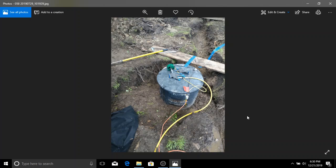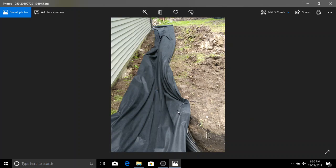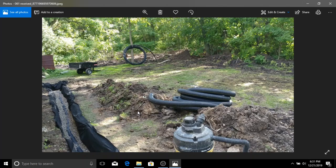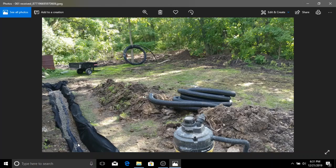Got it empty and then started filling back in — now I'm starting to put stuff back together. Laying out the fabric around the garage. I got fabric going in the front, the slotted pipe, and then the solid pipe — that's the solid pipe for the downspouts on the west side of the garage. The corrugated slotted pipe is under there, and the solid pipe from the downspouts goes through here and into a Y connector. There's another downspout on the other side of the garage too.